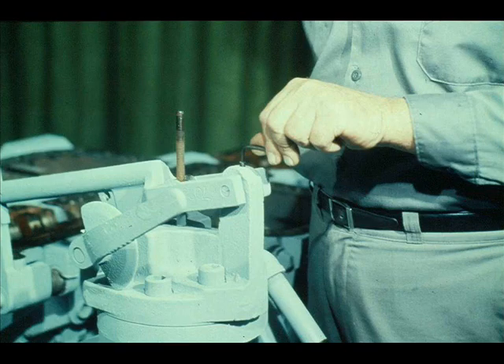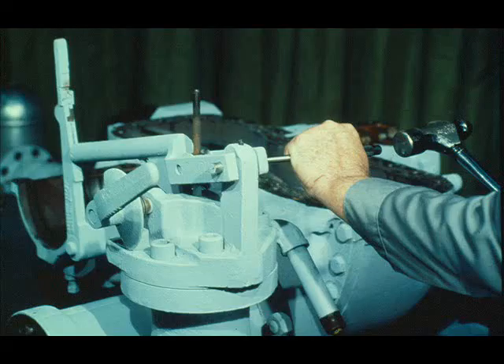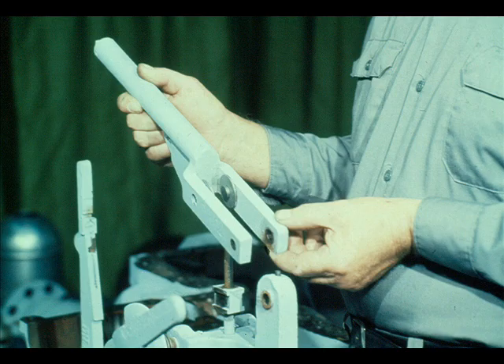The resetting lever can now be moved out of the valve stem connection block and lifted off the stem, as the workman is now doing. Before going any further in your disassembly, remove these guide blocks from the resetting lever and place them in a container, since they are not held in place and could fall out and become lost. Another measurement must now be taken: the distance from the top face of the valve stem connection block to the end of the valve stem. Record the measurement for reassembly.